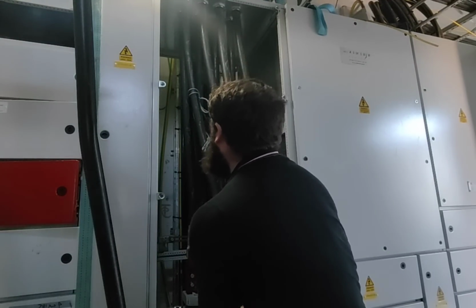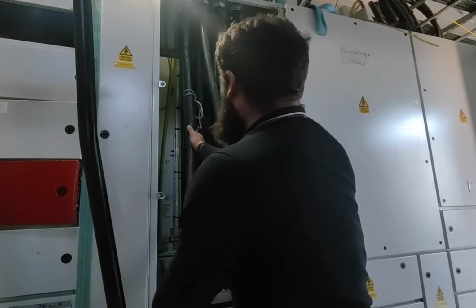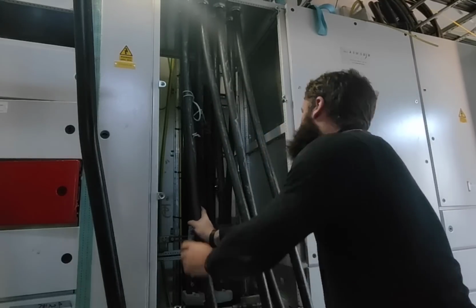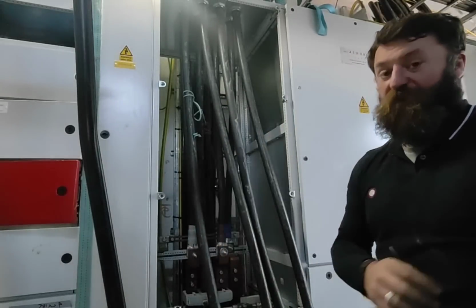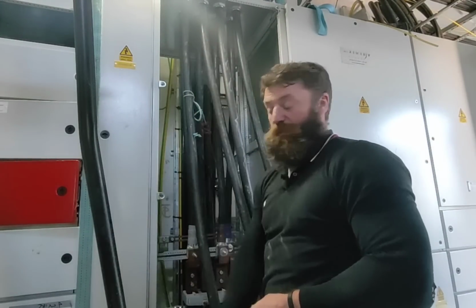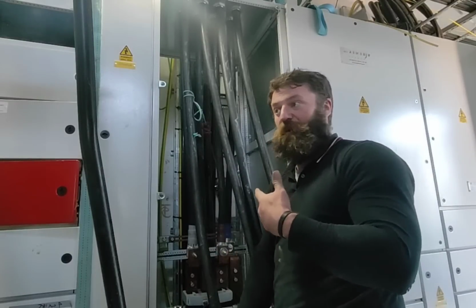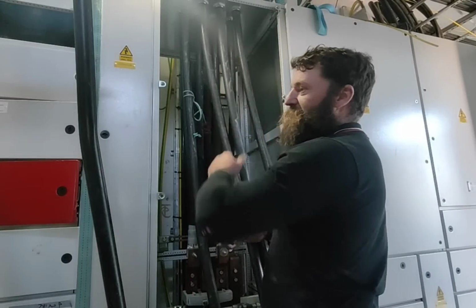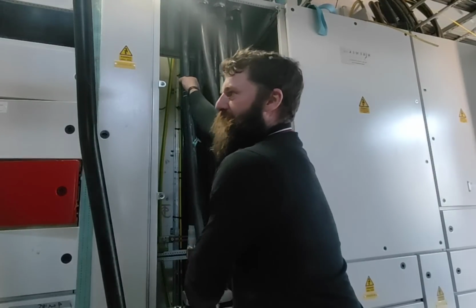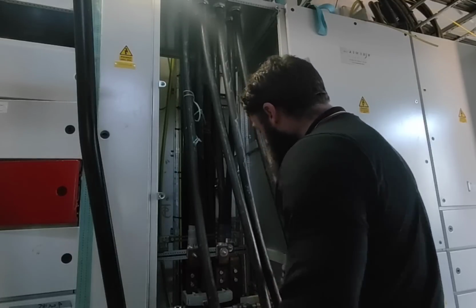I didn't realise that. It's only a 6mm bit of rope. That's not too bad. That's not too bad. I would prefer not, obviously, to have to bend 630mm single cables, because you just want them to drop straight in. But if you ever find yourself up against this, that's a way of doing it, trying to find an anchor point to bend against. Obviously you couldn't do it with your hands, because it just needs to be too strong.